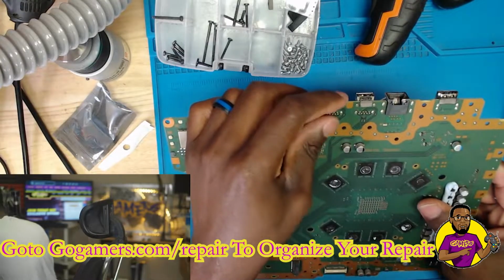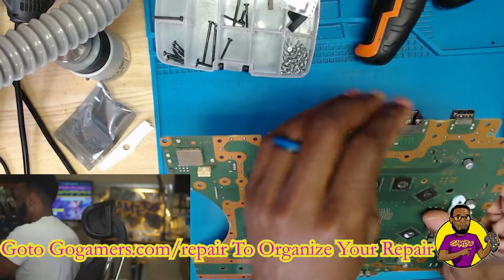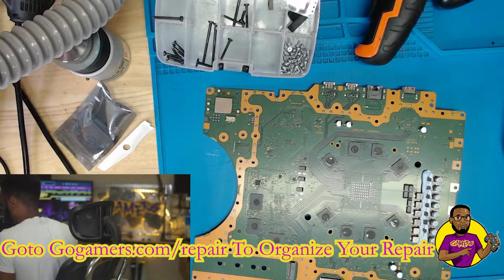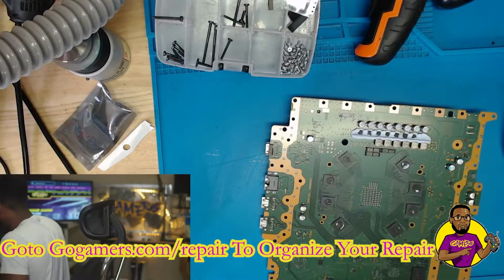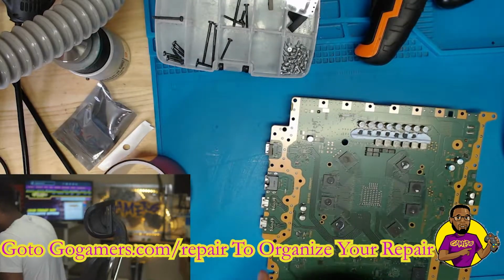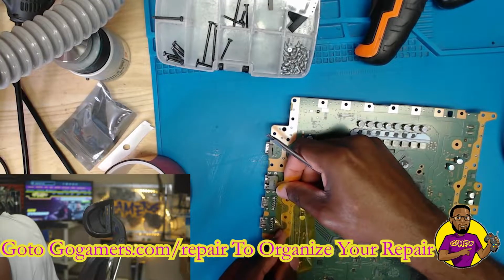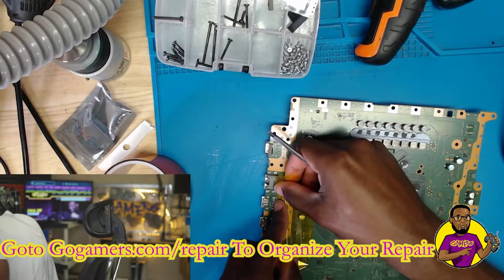So what we're going to need to do is wrap this thing with Kapton tape. Now, Kapton tape is very important when doing any type of flow job on a motherboard, especially if you're going to be pushing a lot of heat to the board. You want to make sure you protect all the components and everything around whatever you're pulling. So what I'm going to do is drop some Kapton tape around this. Link to the type of Kapton tape is in the description down below. And as soon as I get this wrapped, I'm going to come right back.